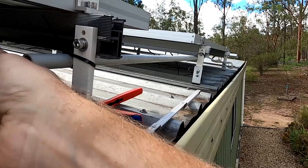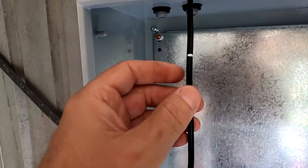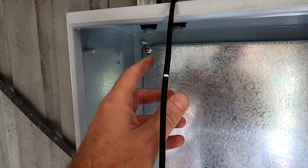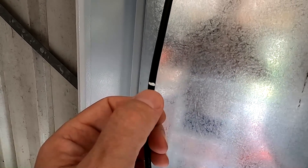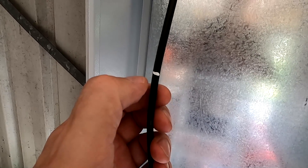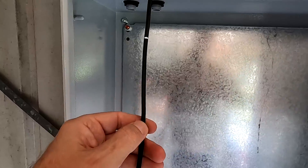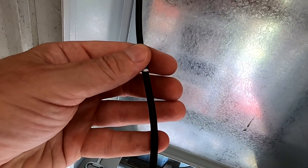Don't forget to put some kind of labels on your cables, otherwise you end up with four black cables coming out and you don't know which one is which. What I do is take a white marker and put a white minus symbol on it — this means negative of the first string. The other cable gets a positive symbol. String number two gets two negative symbols and two positives respectively. I mark them in three different locations along the cable so if you cut off one label, it doesn't matter. That's just my system — you can use post-its or whatever works for you.